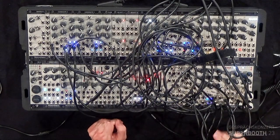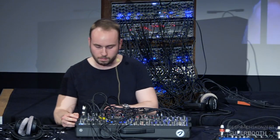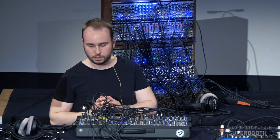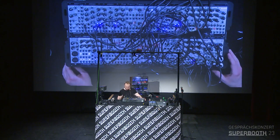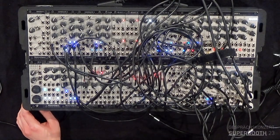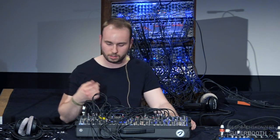And then output-wise, we have the actual delay outputs, as well as minus and plus outputs. So this is what we call our split phase topology. It's a negative wet and a positive wet. So this allows you to put the delay effects actually in the side channel of the stereo field. And that's great for turning mono signals into stereo. We've also got dedicated inputs for through-zero flanging, and everything is voltage controllable. So you've got voltage controllable feedback, time modulation, damping of the feedback line.